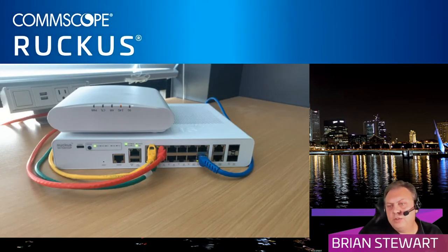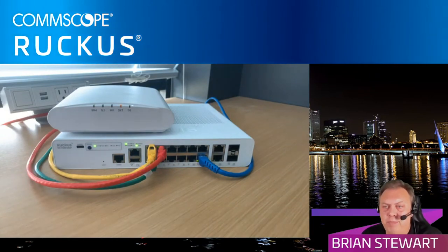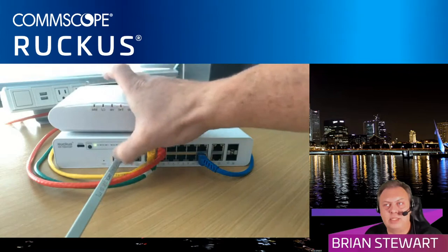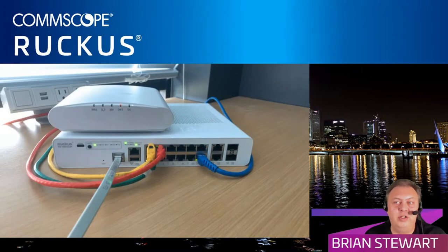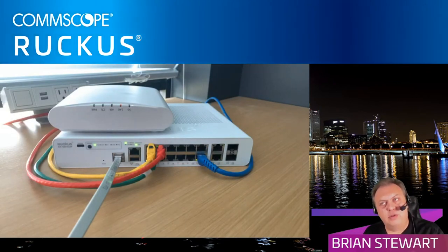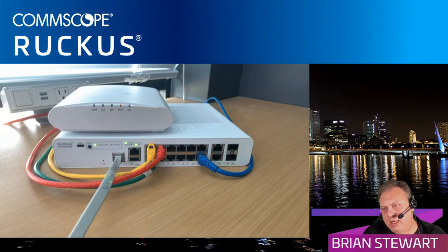Okay, and while he's doing that, regarding the earlier question when the audio was cutting out, there was a question on the probes. We did talk about the Ethernet ports on there: both of those can be used for data, but only one will take the power over Ethernet. But probes, you can turn on whether you're using the 2.4 and the 5 gigahertz radio or either one of those, and your probes are actually a wireless signal. So those would only go out there. Those would not be transmitted out the physical Ethernet interfaces. So I think the answer to that may have been missed when we were still having audio issues earlier.